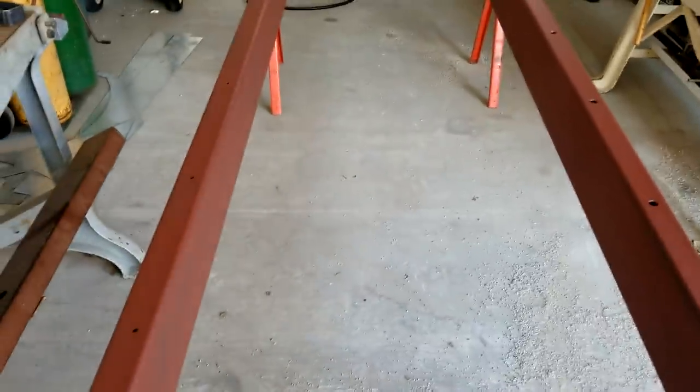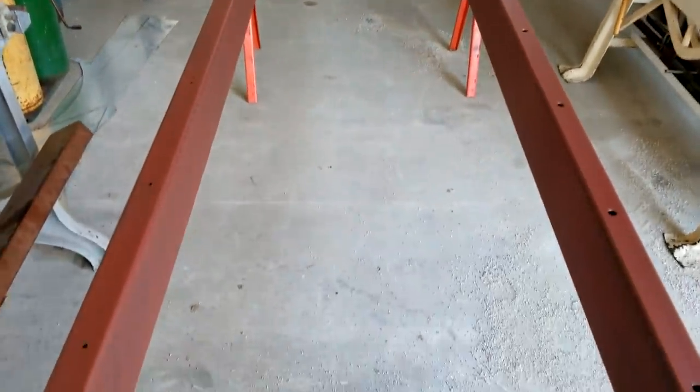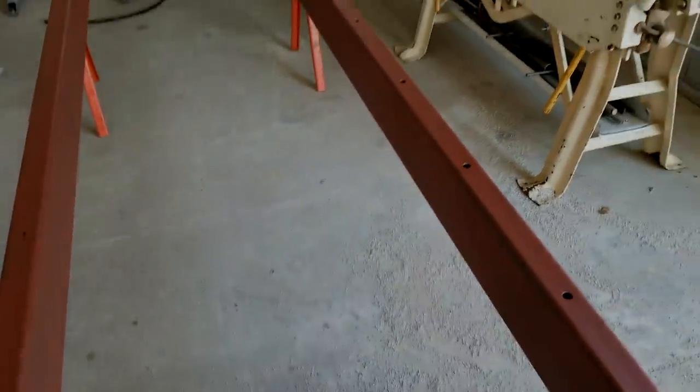They're a beautiful shade of red oxide primer and I think they're going to go flat black. We attached our 2x6 rectangular through these large holes on this side — directly opposite we've got a quarter-inch hole for clearance and just put a tech screw in there using a ridiculously long driver bit that barely fits in the hole, but you can fish around, find the hole, and send it through. When you're done you just cover it with a simple plastic cap that blends in nicely. All those holes are going to get plugged up with plastic caps and the jamb is finished.